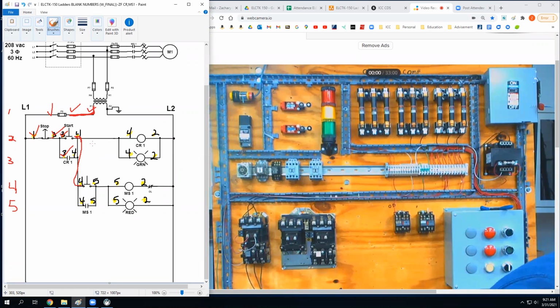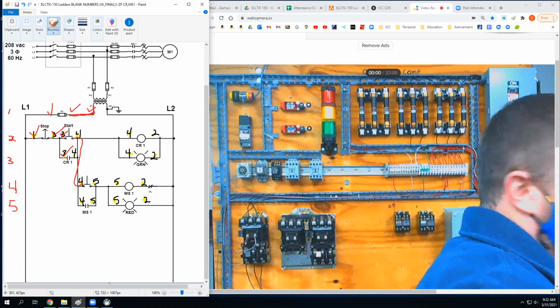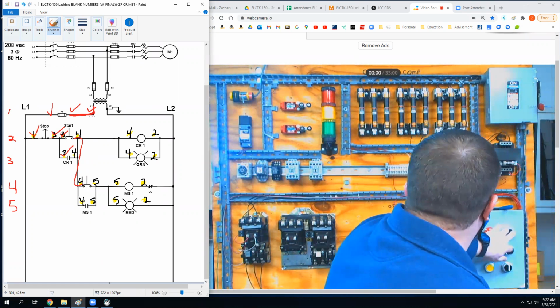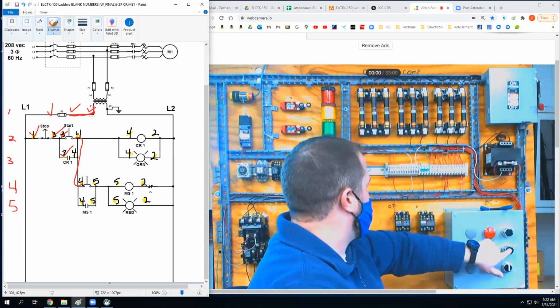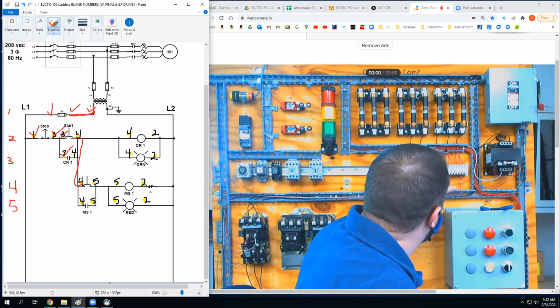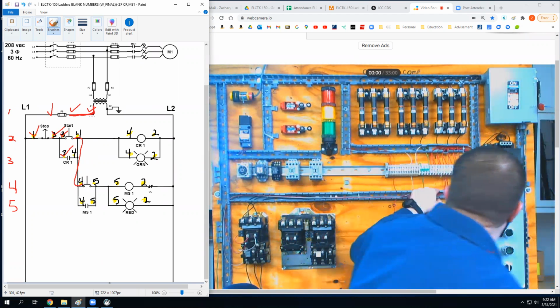But really, you could go from this point to anywhere. You could go there, you could go here, it doesn't matter. All those 4s are going to be connected, right? But for the sake of doing things easily, I'm going to do this little guy first. So start to another start, and that's going to be this button, normally open, and I already know because I've labeled it, this one is the other green button. Okay, so